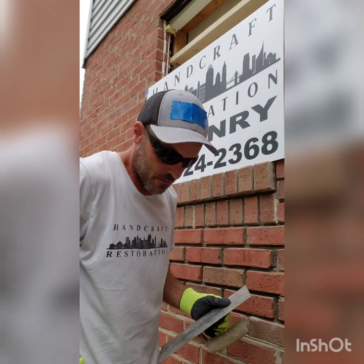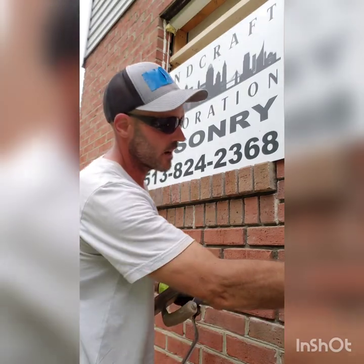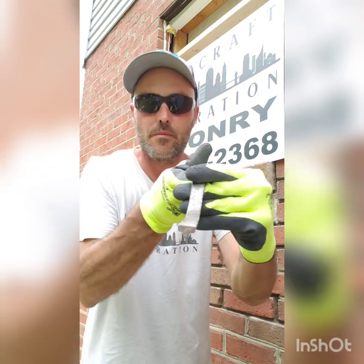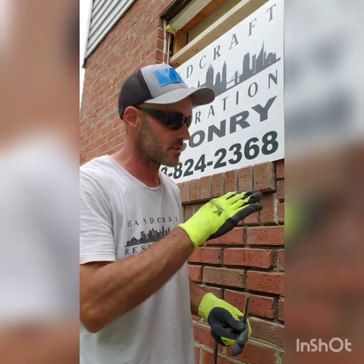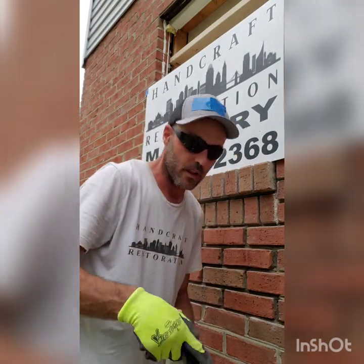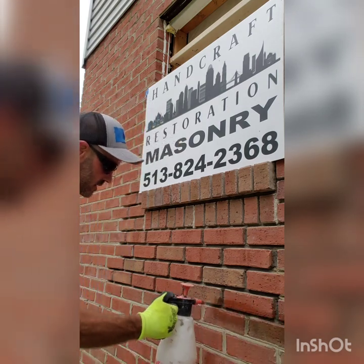This particular job has what's called a grapevine joint — it's got a line that runs down it. The magic words in restoration are 'match existing,' so I have my grapevine joiner here. It's got two different ends and it basically just scores a line down the middle. These are great to use on new homes if you choose a brick that's rough and wavy, because it kind of hides the fact that the brick is a bit crooked. So I'm just going to hop in and explain what I'm doing as I go along. I'll use a pump sprayer and go through and wet my joints down.